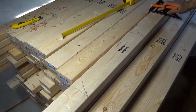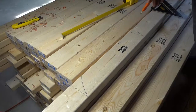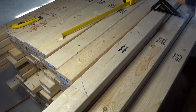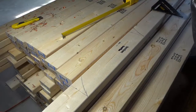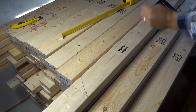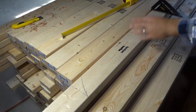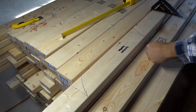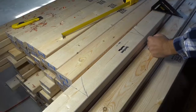You just keep doing that until you get to the end of the wall. You obviously continue until you get to the end of the piece of wood or the end of the wall frame, and then you place a stud at the end of the wall frame. But that's basically it. In this video I have shown you how to mark 16 inches on center — it's a really easy process and I've outlined all of the steps for you. Thanks for watching.